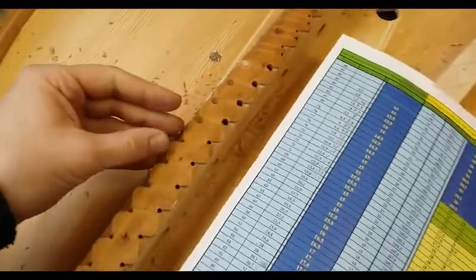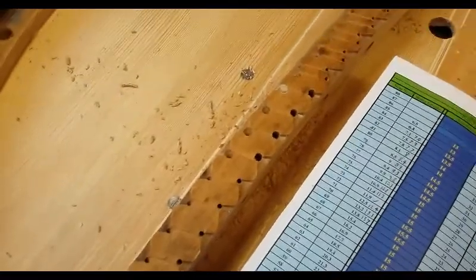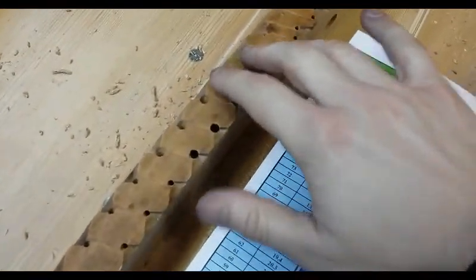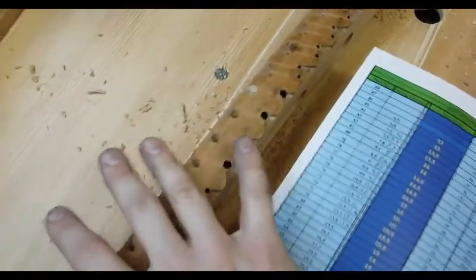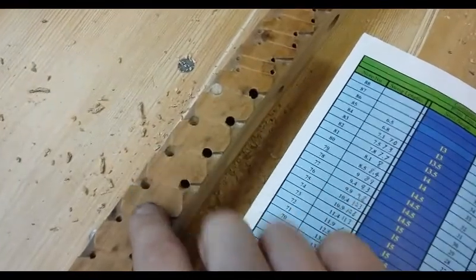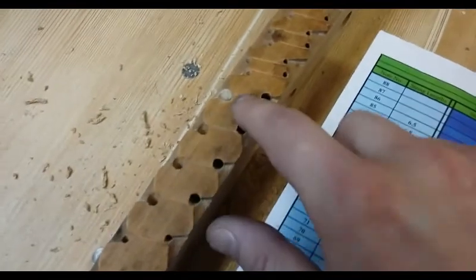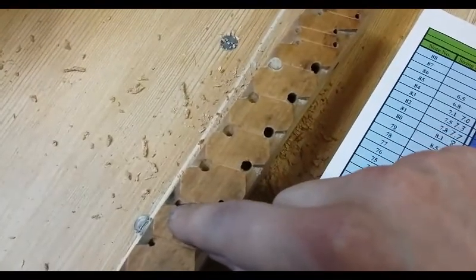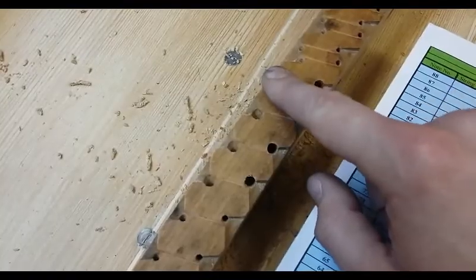So what we're doing is extending how many bichords are on this piano — it had too many monos, so we're turning them to bichords. We're doing that not by putting an extremely large pin in to plug the hole, but by drilling down the original holes far larger and then plugging them. Luckily Phil's here because Phil's going to be the one doing this work today.